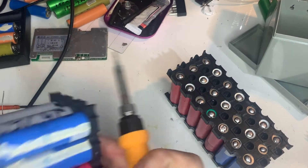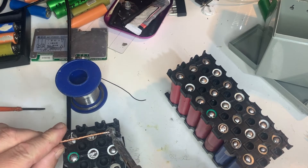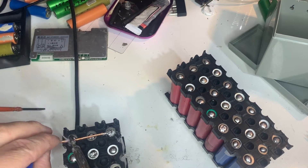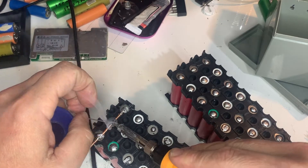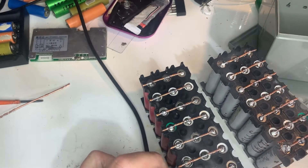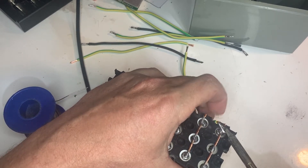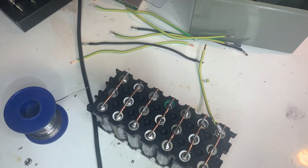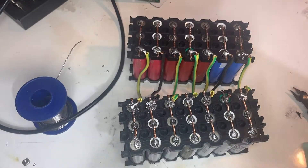For 7s I had to change the cell layout — they go a different direction. I'm soldering the bus bar directly to the bottom. On the top I'll use fuses. I've cut wires to join the two battery halves together, now I'm soldering them on and we can put the two batteries into the box. It looks a bit messy with all the wires but my solder joints are good, and once it's in the box nobody will know.